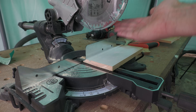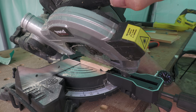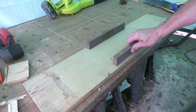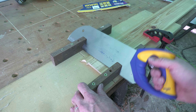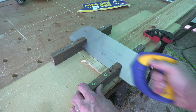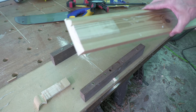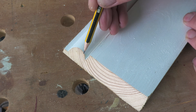The next thing you need to do is cut a 45 degree bevel on one of the corner pieces. No need to do the other corresponding section because that will simply be cut at 90 degrees. And if you don't have a sliding bevel mitre saw it really isn't a problem — you can make a 45 degree jig like this one that I made several months ago. What that 45 degree cut does is reveal the precise outline of what you've got to cut out.